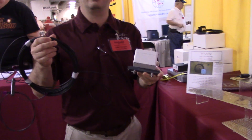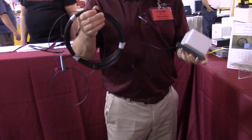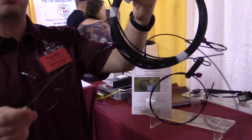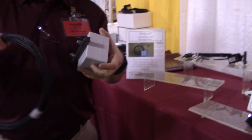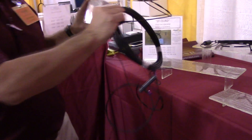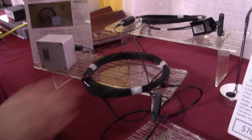You can run this antenna sloper, horizontal, vertical, inverted L, inverted V. One thing you want to be aware of if you did want to run this vertical is these stubs need to hang freely. You want to make sure that those don't fall back and radiate against themselves. So you want to ideally run this as a sloper. But if you're doing DX or for field day, this is a phenomenal antenna. What does it cost? What would someone pay for that?